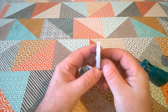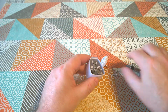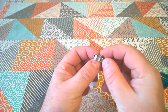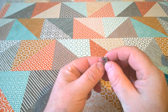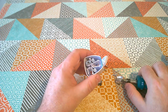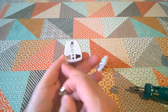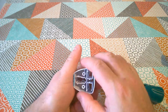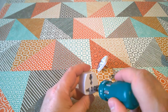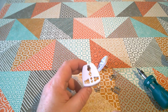Okay, so yeah, all we've got is these two little pin pieces here, which contact these little spring terminal pieces. The construction is just pressed nickel plated, well, nickel plated something, possibly nickel plated steel, maybe nickel plated copper or brass. But there we go, there's just almost nothing to them. And these are just designed, that one's meant to be the ground or earth. That'll be the live and neutral. So there's just almost nothing to them, but look, I can bend that plastic casing with my fingers, and the apertures there are easily big enough for pens and screwdrivers and scissors and any kind of metal object, or indeed a child's finger could probably go in that hole.